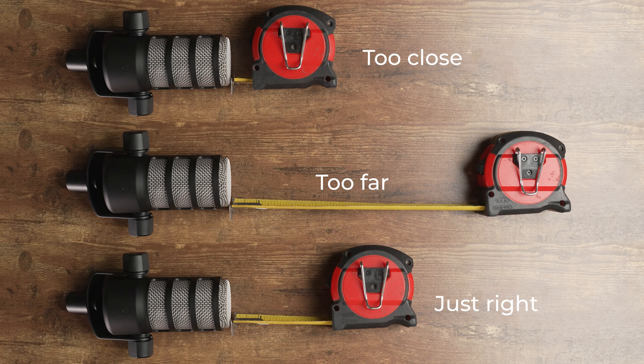I will have timestamp links if you want to skip this part and get straight to the post-processing. Number one is microphone distance. The closer you are to the microphone, the less you have to turn up the preamps and the less noise you have in your recordings. You'll also typically get better bass response to give you that boomier broadcast quality that people are after. If your mouth is too close to the mic, you'll get more sibilants and plosives — the S's, P's, and B's. On a dynamic mic like the Rode PodMic, I like to have my mouth about four finger widths away from the mic.